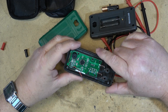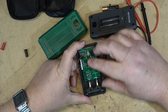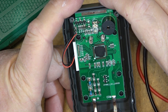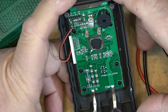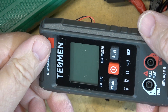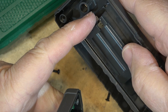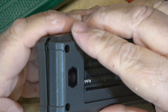With the back off the unit, you can see it's basically a one-chip solution. There's the buzzer, an LED for the flashlight on the back, and an LED for the display. The chip itself is just under a blob of epoxy, so you can't identify it. Like all basic meters, there's not much to them — some resistors on the input, a couple of transistors, and one IC. The buttons will be your standard rubber buttons with carbon pads on the back, like remote controls. Power contacts through the battery onto two little springs. The non-contact voltage detection is that metal strip over here — that's what's isolated and detects the voltage.